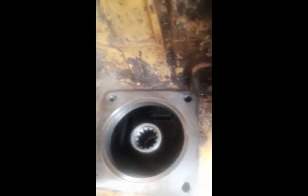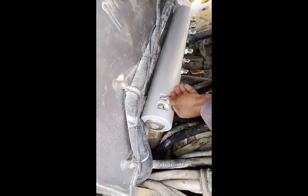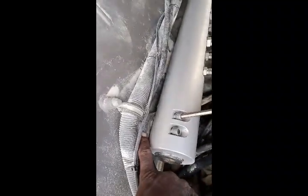You can see this big hose coming from the hydraulic tank. This hose is attached to the suction port of the pump. Here is the area where we will attach our front pump. This big white pipe has all the return hydraulic hoses attached to it — through this pipe the return hydraulic oil goes back to the tank.